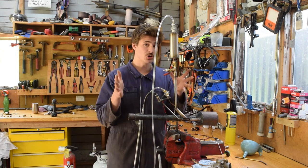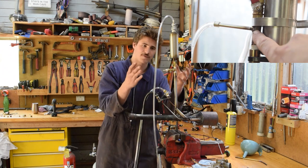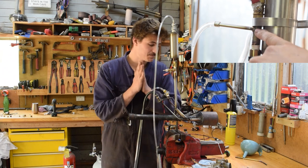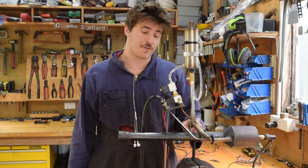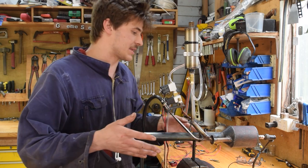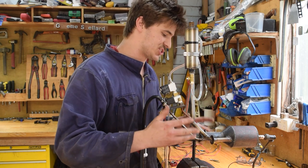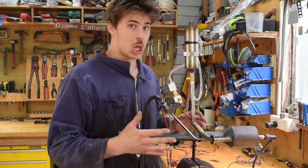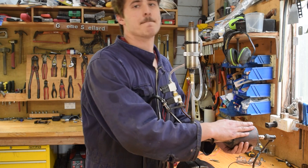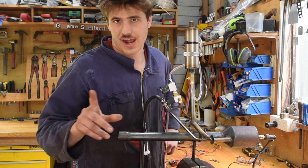So, adding some cool factor, why don't we design our own Venturi pump where we could draw our diesel in to the flow of air, atomizing and just having a much more controlled and safer diesel system. The diesel injection system is far from perfect. It condenses. So about 60% of the diesel gets mist formed inside the pulse jet, which is fantastic, but about 40% kind of is just these droplets that go everywhere. Not ideal, so I added these little cones to capture everything because spraying this red hot pulse jet and the surrounding area with diesel is not ideal.